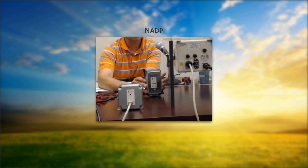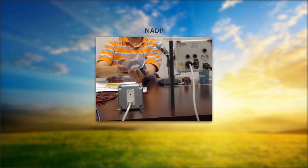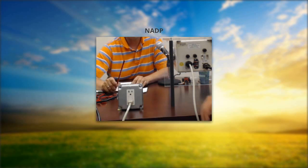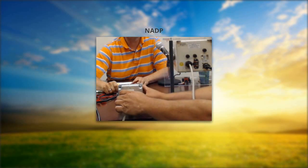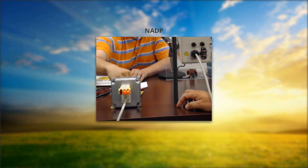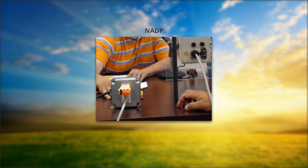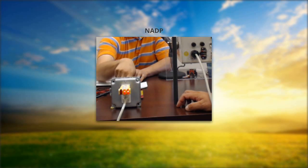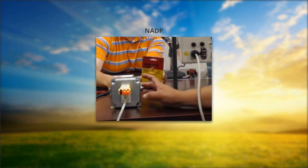One thing I did not do — as soon as I reset that GFCI the collector opened, but I don't want to assume everything is working properly. So I'm going to take the receptacle tester and plug it into the outlet that was supposedly having problems. I'm getting the bright yellow lights, which indicate that everything is okay with that particular outlet. That makes me feel safe to conduct my sample change, and confirms the problem has been resolved.